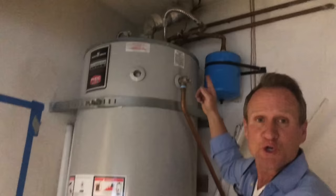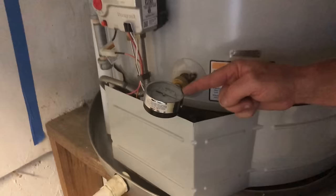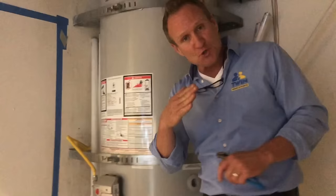Now that we've got pressure and we've turned off the valve on top of the water heater, if you start to see the needle drop towards zero, you know that you've got a leak on the hot side. Go ahead and make sure that all of your faucets on the hot side are not dripping, but more than likely if the pressure is dropping, it is the water heater that is leaking. Hopefully this gave you some tips and tricks for diagnosing a leaking water heater. Thanks for watching.